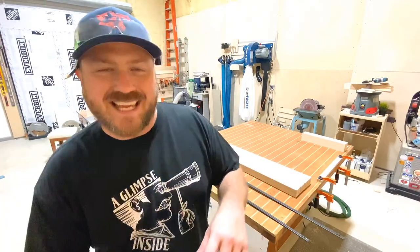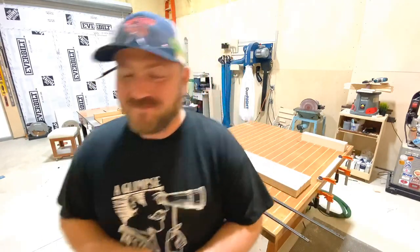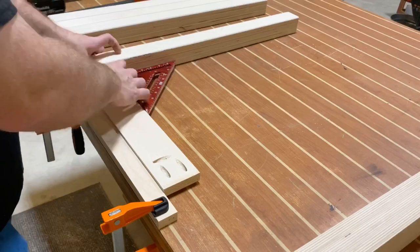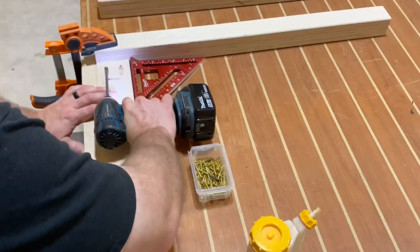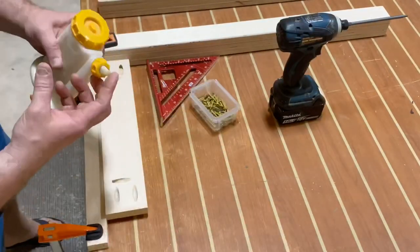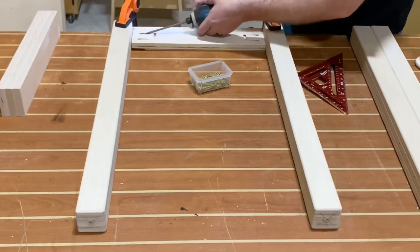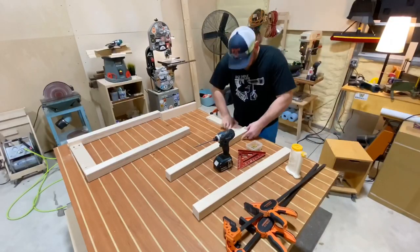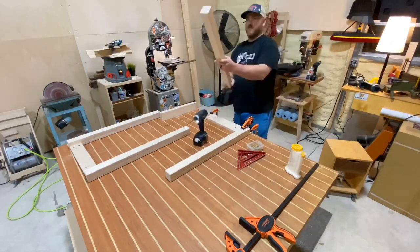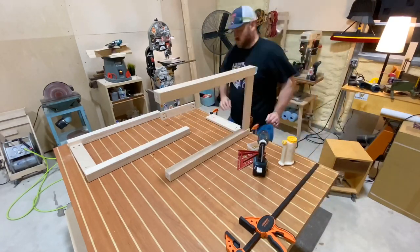I'm going to show you a way to join the legs and the aprons together to make one piece, and then join that to the tabletop. Because the legs have a quarter-inch roundover, I'm using a quarter-inch plywood spacer to raise up the aprons before I attach them to the legs. This essentially makes the roundover end and the apron begin, giving it a nice polished look. There are six pocket holes per apron. Be careful — you don't want to angle the pocket holes facing downwards as you assemble. You want those two pocket holes facing upwards so they can grab into the tabletop.